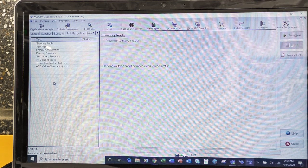That is measuring if the vehicle is turning around in a circle, a central position. So it's going to be basically geographically in the center of your vehicle or piece of equipment. So for example, if I'm going into a corner on a semi, it's a little bit icy, and the back end of that semi, the trailer, the power unit, starts making a right-hand turn. So instead of just tracking around, it's actually starting to spin out, and I'm starting to lose control of the back end of my tractor unit. So that yaw rate will come into effect.